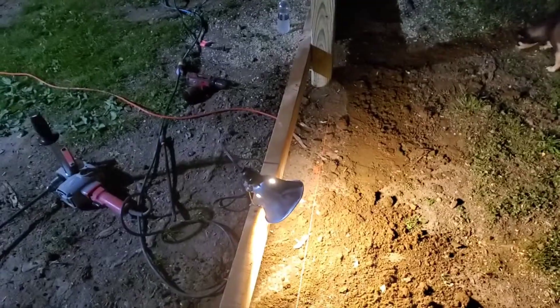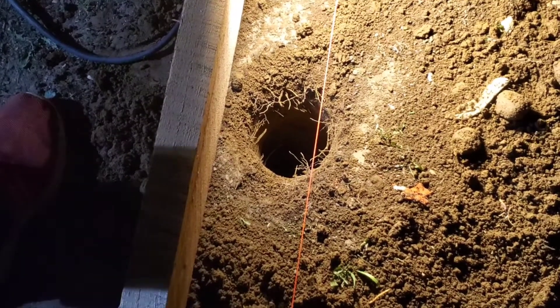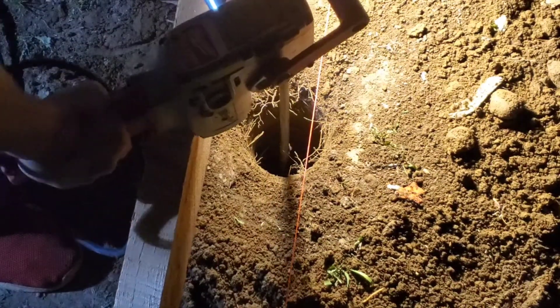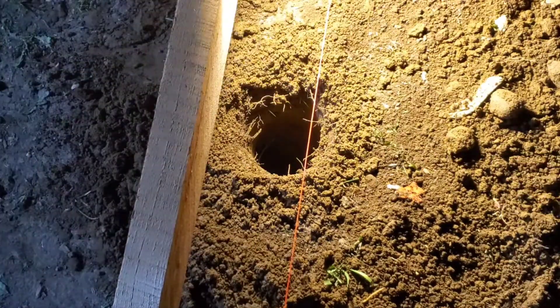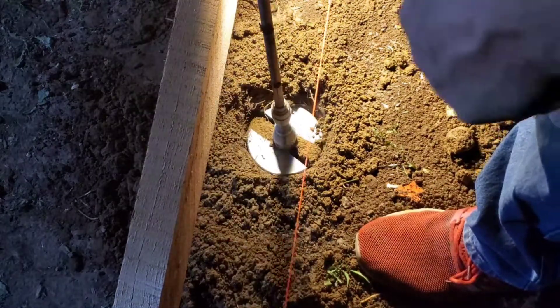So this is one of the four-by-fours I cut up into wedges. When I went through the center of the stump I pounded the wedges in to bring me perfectly level front and back. I've got my tripod — I'm going to show you what's going on for some of the non-believers going, 'Oh my god, you can't drill down in the dirt like that.' Well, you're going to see it right now. It has no trouble whatsoever. The only problem is I got this two-by-four in the way — you've got to be careful not to cut the string line; I've done that a few times. Alright, I've hit my bottom — the drill is hitting on this two-by-four so I can't go down any deeper, I've got to get on this side now.